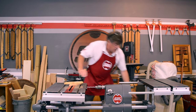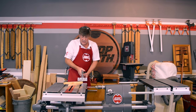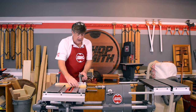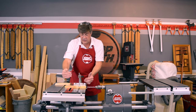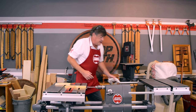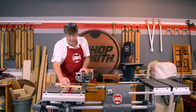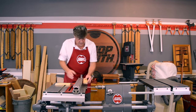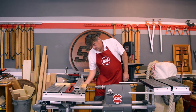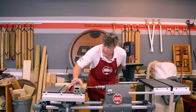We're going to borrow the miter gauge. If you want to drill a six-foot coffee table and you've got a six-foot piece of wood, it won't fit under the drill press. But with the horizontal boring machine, we can bring our miter gauge up and drill from any angle — 90 degrees or any angle on our protractor — into the end or the edge of that piece of wood. We're going to use our rip fence as a backstop on the horizontal drill. As we tighten it up, it's going to automatically align itself to the table, with no movement in the back of that fence.